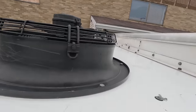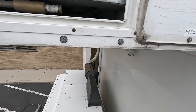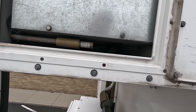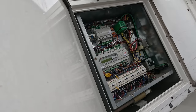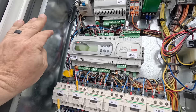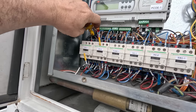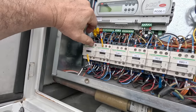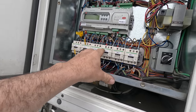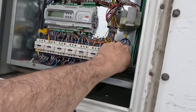All right. Well, what I noticed was down here on the bottom, there's a breaker that was tripped, which ain't good. So we're going to go ahead and see if we can get this thing opened up, find out which one's shorted. I'm assuming that's what's going on. So it's got one of these wonderful control panels. Okay, so we've already got something, it's taped off here. They've already unhooked something, compressor contactor 1, CC2, humidifier maybe, heating contactor. So, we've got our power here.